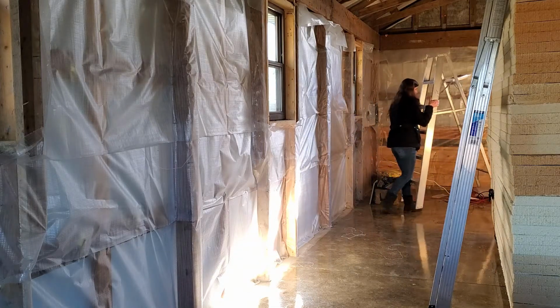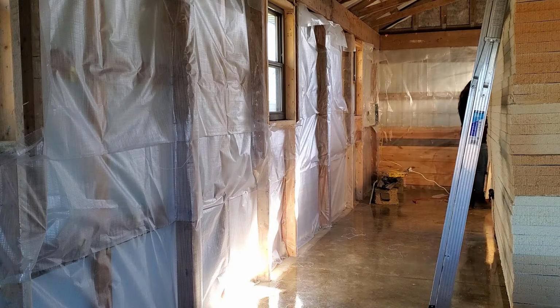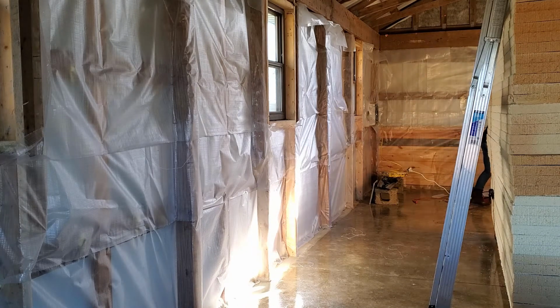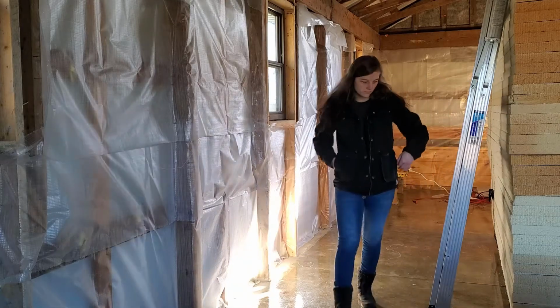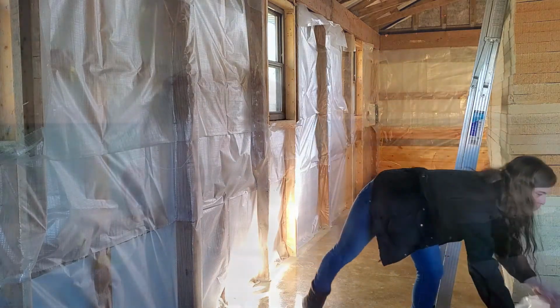So, although we only showed you the east wall and a little bit of the south, rest assured that the rest of the walls were outfitted basically the same exact way. Yeah, the process was quite repetitive. We held the plastic up, stapled it, stretched it, pulled it tight, stapled it again, and so on. Thank God we had some extra hands, my brother Andrew and my dad Jeff, so thank you both if you're watching this. That went way faster having help.